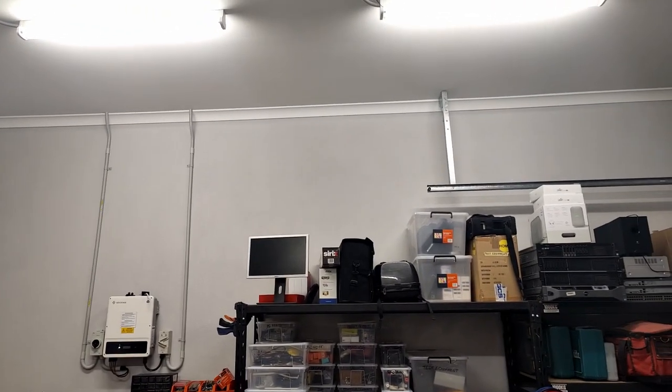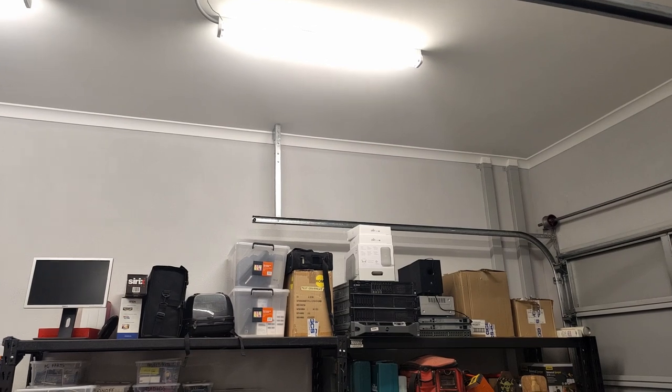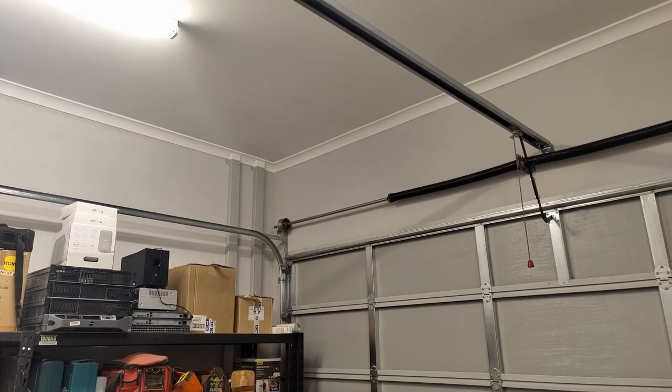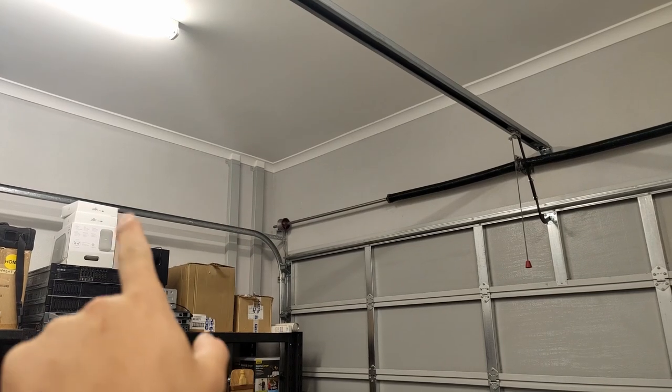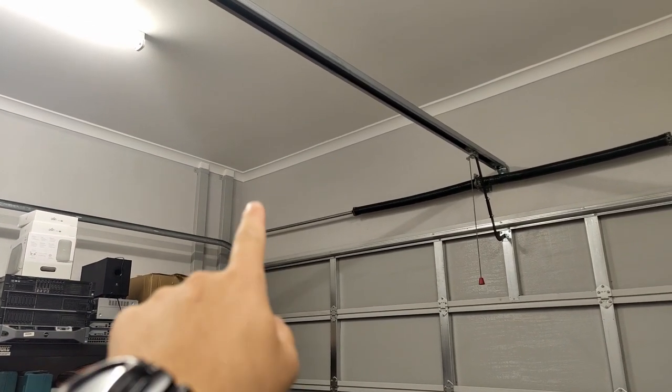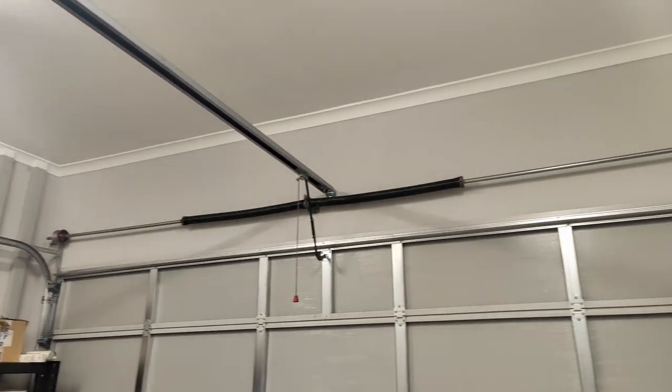First up, I decided on location and layout. The easiest route for me is to extend cabling and conduit around the inside of the garage walls. To go through the wall cavity and ceiling would mean removing sheets of roofing, which is a bit overkill. There are a few obstacles to avoid, but in the end I'd like to penetrate the wall in two places, which will provide a place for Ethernet cables to get outside.